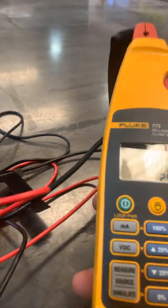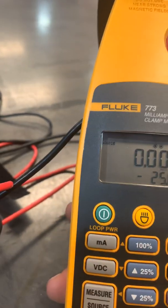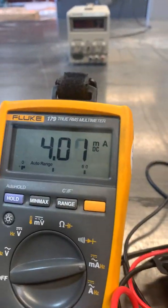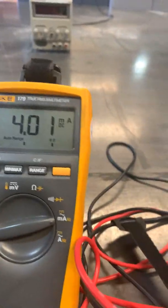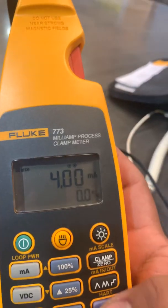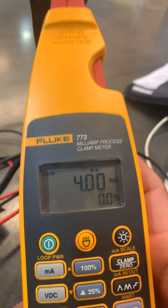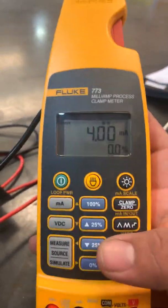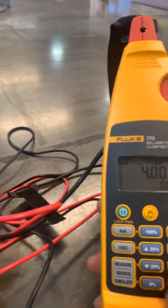Go to source and we want to send a signal back to the PLC. Zero percent is four milliamps, so we're measuring four milliamps in the loop right now. For zero percent, four milliamps — if you have a tank, you're simulating it at zero percent. This is the transmitter sending a signal back to the PLC saying you have zero percent.